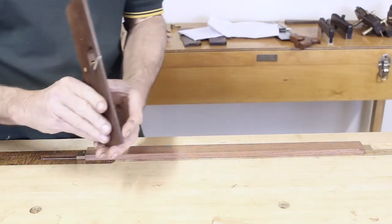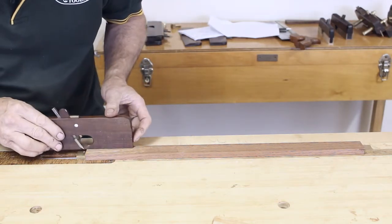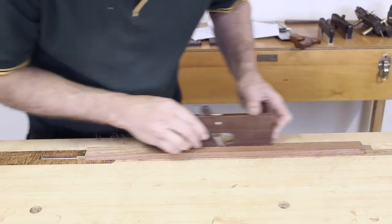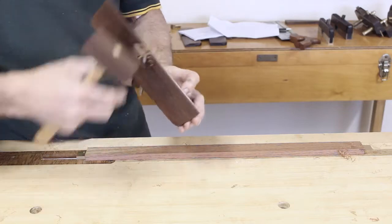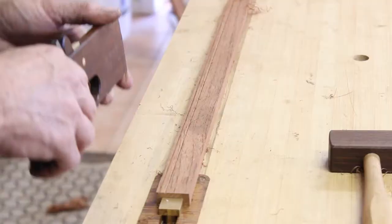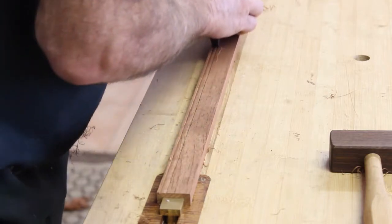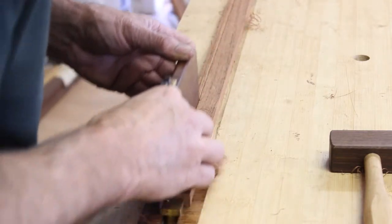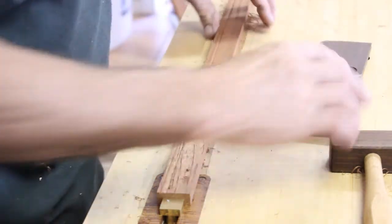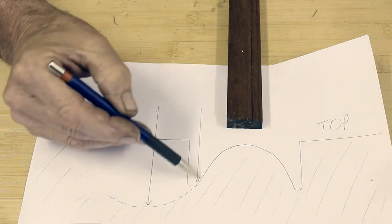Make them look nice and even. Then take your plane — make sure it's nicely laterally adjusted so you can just see a nice black line as your profile. That will be enough to run that plane. If there's a lot of material to take off in bigger mouldings, set your blade a little bit deeper. Keep planing till you start to get a full-width shaving — your first couple of passes will probably have a split shaving, but that one there is a nice full-width shaving.